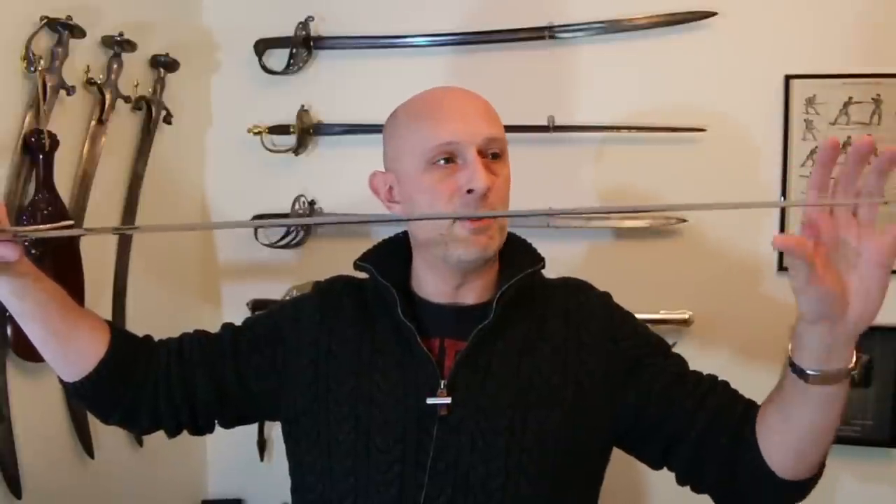What we've got here is a sword that aesthetically has a high level of polish, a very good level of grinding with minimal rippling, and a very straight fuller. But perhaps even more than that, what we've got is a blade which observes a lot of the proportions we seek from a good replica medieval sword — and that often comes down to distal taper. There is also edge geometry to look at.